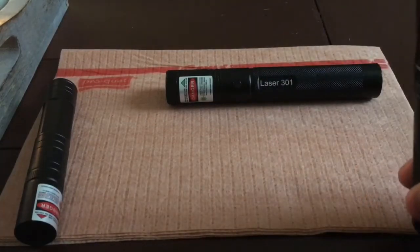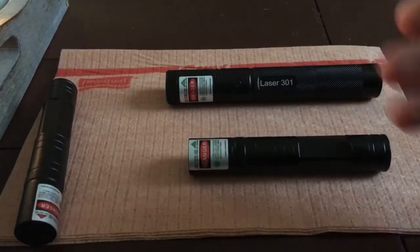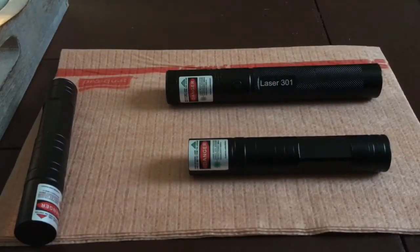So if your glasses could handle that wavelength, then it obviously would not show the infrared light. And if it doesn't have an IR filter, by wearing those glasses you'd be able to notice — when the green light is completely blocked out and you can see red light — that there is no infrared filter on the laser itself. So keep in mind: these two lasers, the 301 and JD850, and probably the 851 and 303, do not have an IR filter.